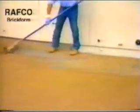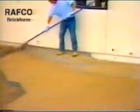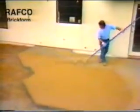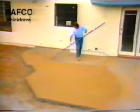After the embossing has been completed, the concrete should be allowed to set for 3 days or more. At this point, the cleanup, pressure washing, and sealer coat application can be completed. Sweep off the excess release agent.